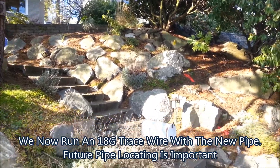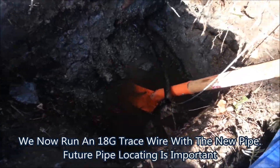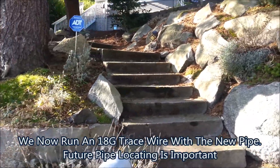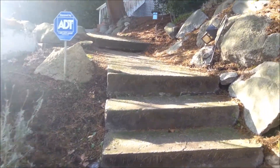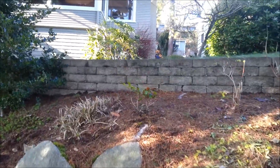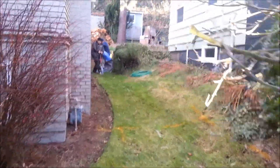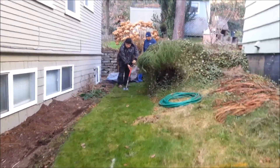We've just finished locating the route of the existing line. We used the metallic fish tape, pushed it through the poly, and used our Metro Tech locator to determine the route of the existing pipe. It's denoted in white paint through the hillside here. It goes up through this rock shelf under the retaining wall, up through the yard, crosses utilities, and enters on the north side of the house.